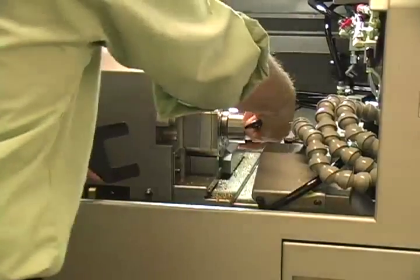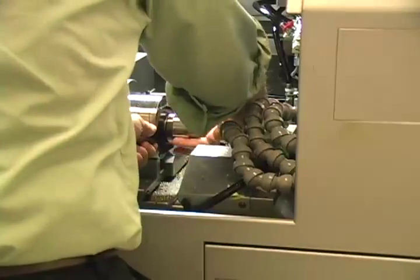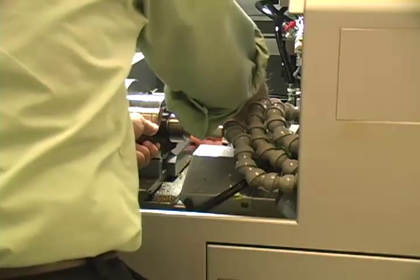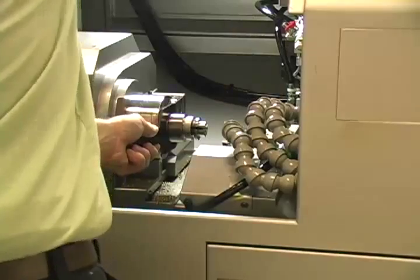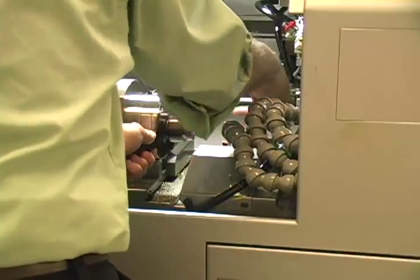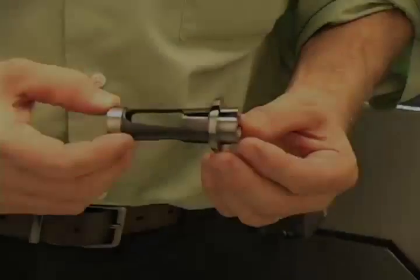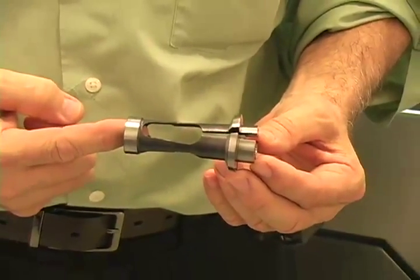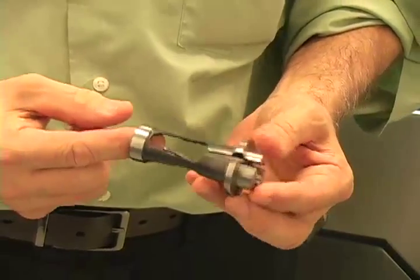To change or install a subspindle collet, loosen the threaded spindle nose cap using the appropriate wrenches. Pull out the collet and clean it before storing it in a collet rack or drawer. Hardinge subspindle collets are hardened and ground. The head angle and the back bearing are the contact areas between the collet and the spindle, and are ground to precise TIR.